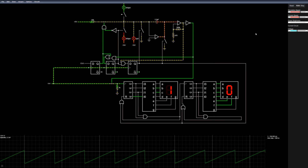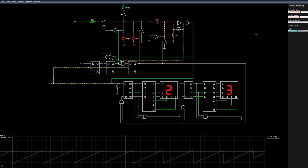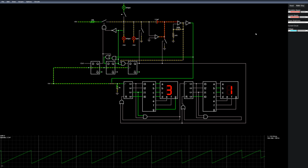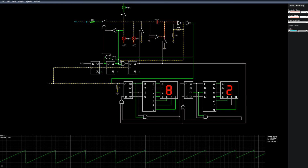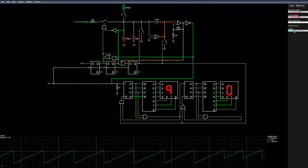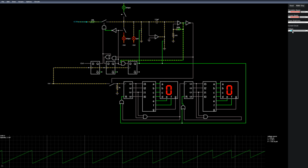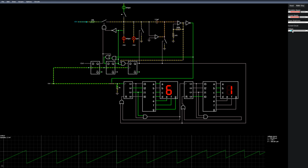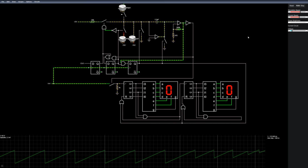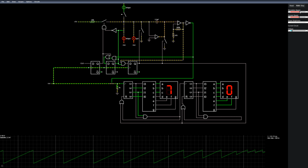But while we are stuck here, it's an absolute marvel that they managed to make this circuit work so well, in spite of jittery clocks, drifty resistors, leaky caps, and analog switches that behave differently from one another and from time to time. Look, even my simulation, consisting of purely ideal components, somehow manages to have noise. The 3 different rundown current sources are what give this arrangement its name, multi-slope ADC. They are derived from an LTZ1000 in this multimeter. That way it inherits the famous stability of that part.